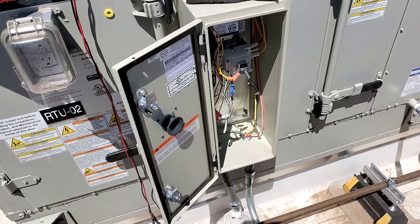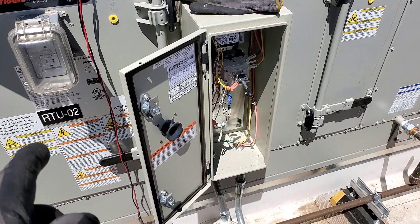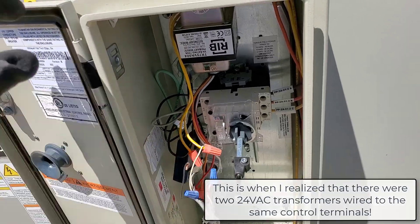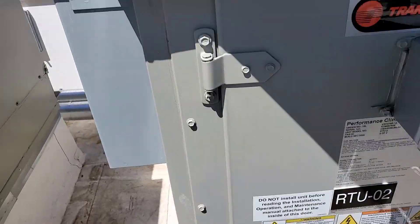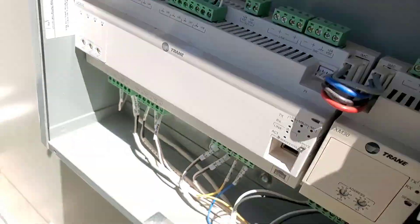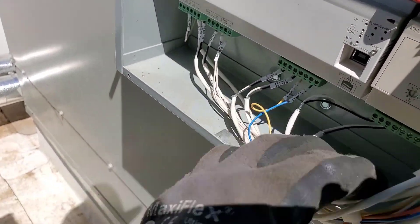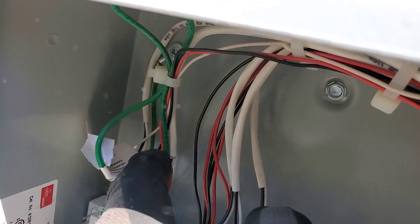That was over four amps at 480 volts - that direct drive electronically driven fan motor is no joke. I just disconnected the output on this transformer and wire-nutted it up. I need to be careful with these wires because it could be back-feeding from the other circuit. This side is dead, and I'm sure all the power above and below ties together.